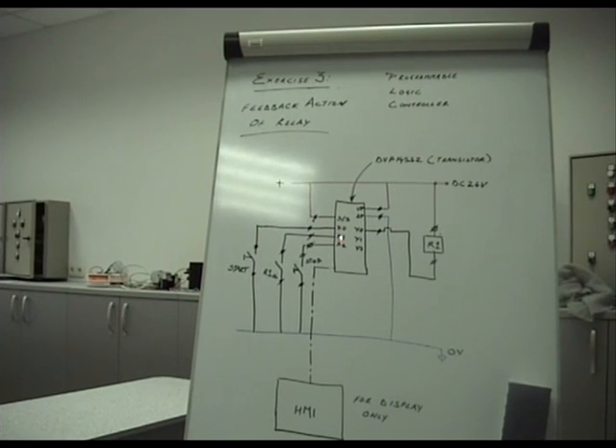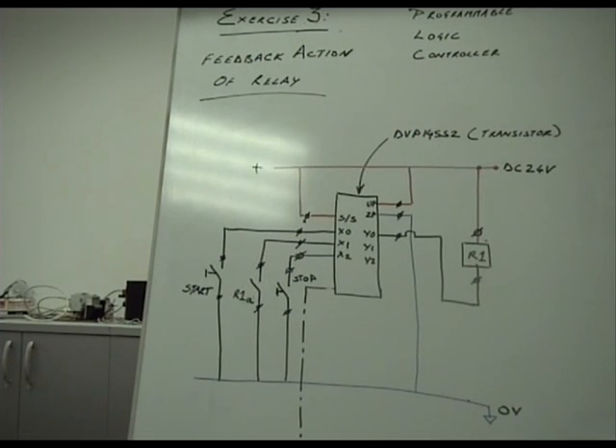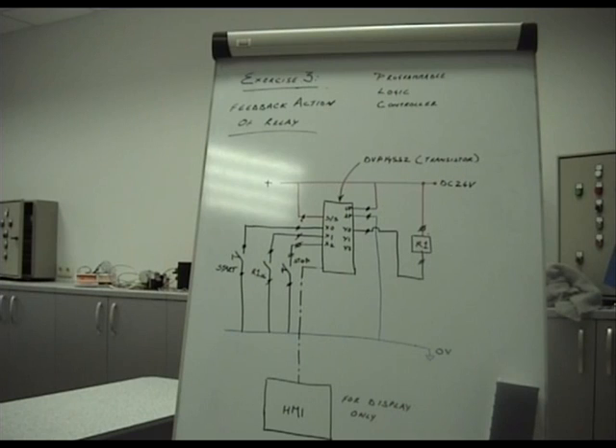The first thing that the PLC logic does is, when it sees the start button registering, it drives relay R1 on. This relay will stay on for about 2 seconds — obviously the pump will start. One auxiliary contact of this relay is feeding back information to the PLC through terminal X1. If this feedback does not come for a period of at least 2 seconds, then it will stop relay R1.